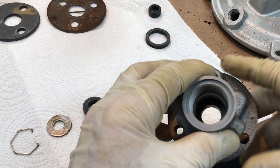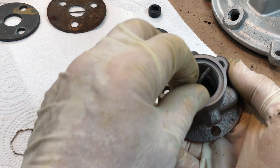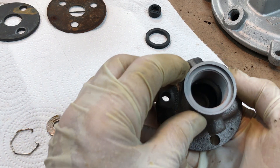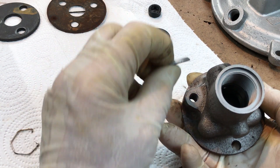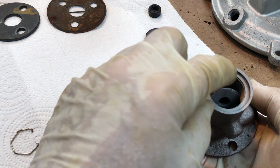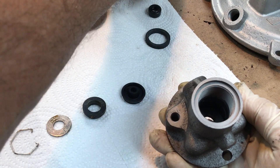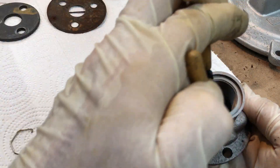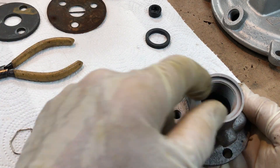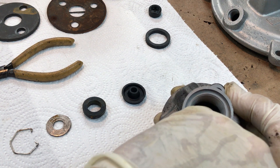Switching over to the other side — this is our stack of parts. Got the O-ring that goes down the bottom right here. That O-ring sits right down there. Next goes your beveled washer and that sits right on top of that O-ring. I do lubricate all these parts when I install them. That O-ring gets lubricated because this beveled washer is pushing against it and acting as a seal down there.